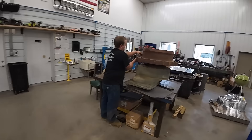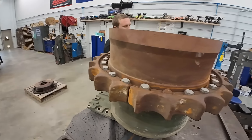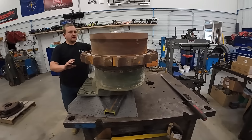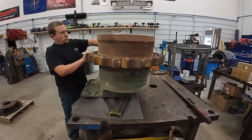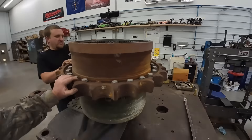I don't know if they put it together improperly or didn't put oil in it — there was no oil in this system. You can see these bolts are loose in here. Don't even know what that bolt is. This part is not new, it looks more original to the tractor. We can get some of these gears aftermarket, or we can get them from John Deere too, but they're very expensive. This final drive from John Deere is somewhere in the neighborhood of about $25,000 US dollars. It's not cheap. The dozer had about 800 or 900 hours. We're going to take it apart and see if we can rebuild it — put it up on the shelf for next time or somebody else. I've actually never been into this part. There's a brake housing on the back I'll probably show you later. Unfortunately, we have to take it all apart and check it out.